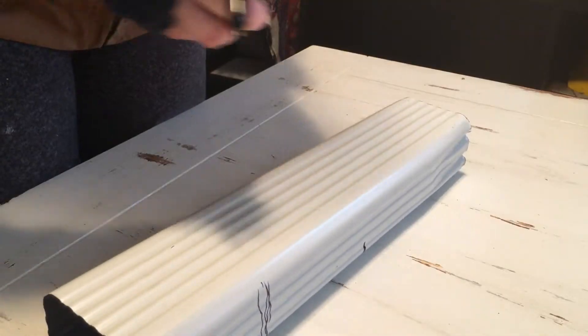I ended up buying an extender piece for my downspout, because I thought the problem was that the elbow at the top of the roof had lost a piece of downspout, and that there wasn't enough length to get that curve close enough to the house so the downspout could actually be attached. This was not the case. The elbow at the top had actually lost a bunch of screws, so that, along with all of the brackets on this downspout, were broken. The upper gutter and that little elbow piece — there was like one screw holding all the weight of this like 20-foot downspout.